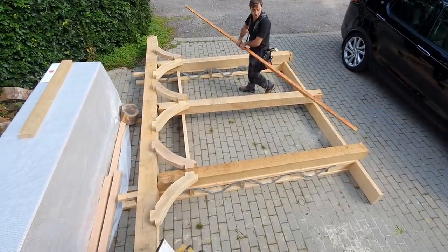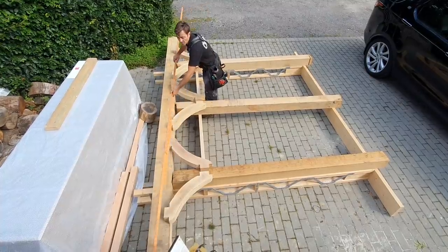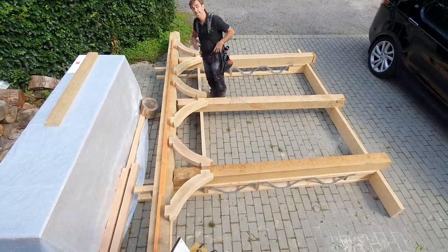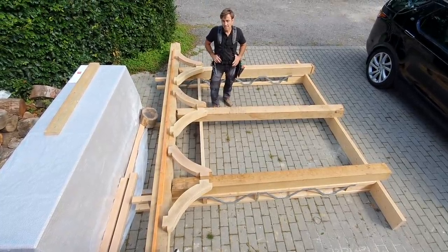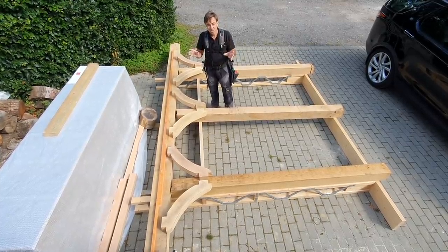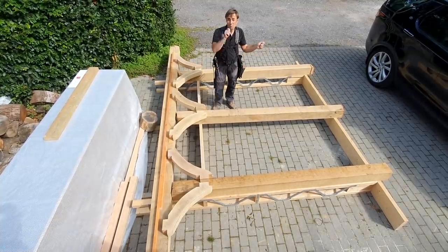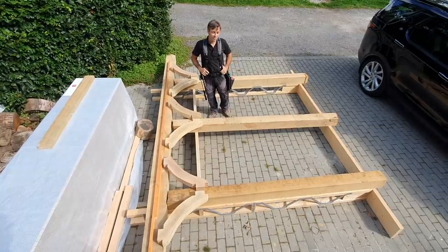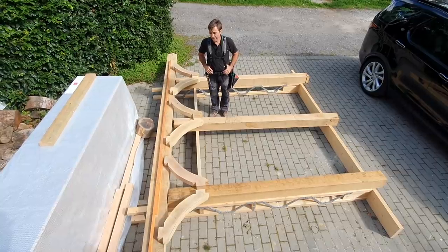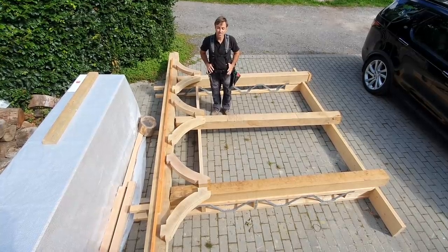So here's the rod. I'll just keep using this all the way through. I've got the wall marked on one end, so when I lay it onto the top of the beam I can then transfer the centres — and that's all the setting out done. I do think that if you were doing it by the measure or writing them down, there are too many opportunities to get those measurements wrong, write them wrong, transfer them wrong. By using that bit of wood and marking the actual centres, you just can't go wrong. It's a little bit of advice, because we're all human beings and we do make mistakes — I've made plenty before, and it's only from those mistakes that you learn. Anyway, we're going to get on and start the process of joining this together.